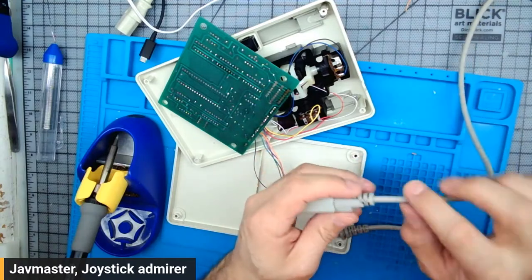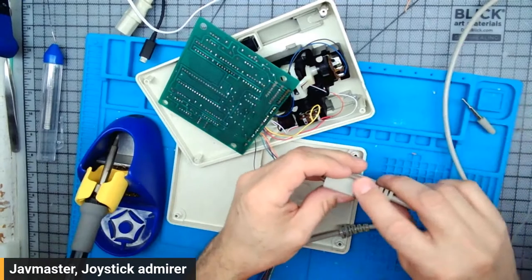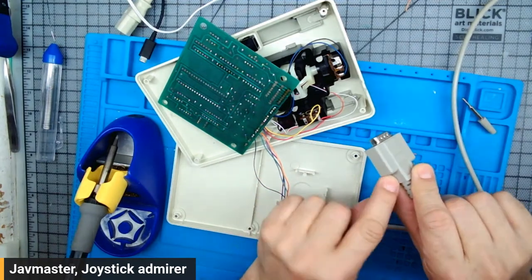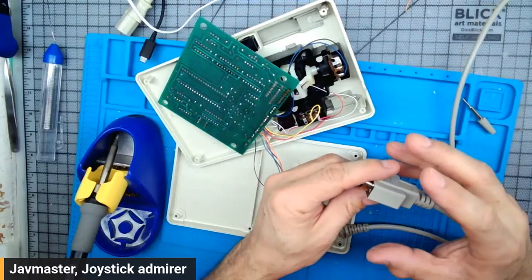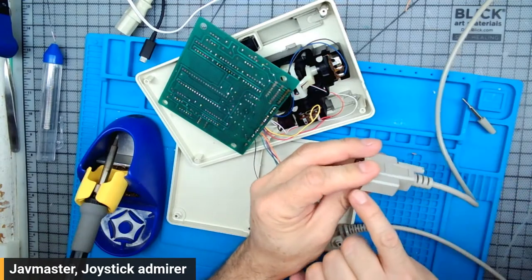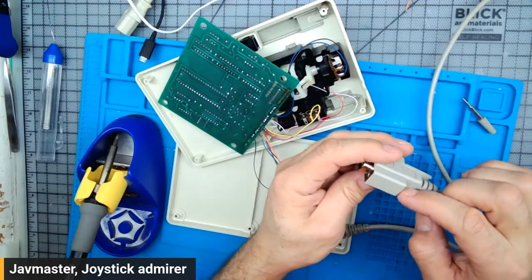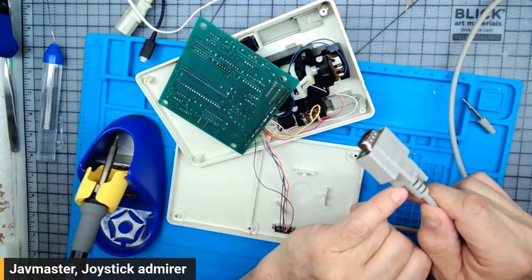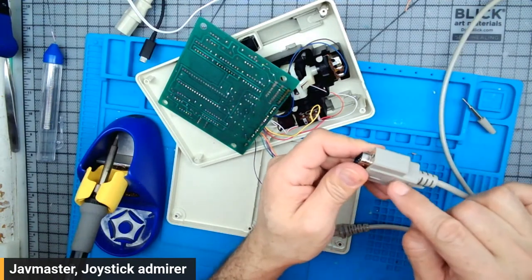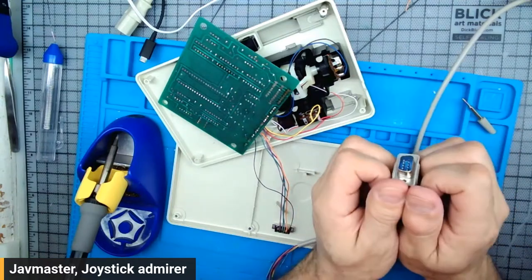So you cut it out. Then what you do is you take out one of these. Normally you just pull them out like that, and then cut this with a blade, with an X-Acto blade. This is a housing. It's a plastic housing that is bonded in there. I think with heat they bond it together. So you can see that it's two pieces that are bonded together with heat. So what you do is you cut it out as straight as you can, and then actually around here, a straight line here. And then go all the way into the metal part, and then you force it open, like with forceps, boom.